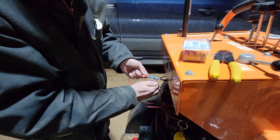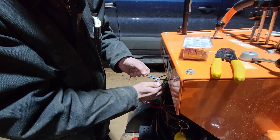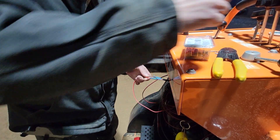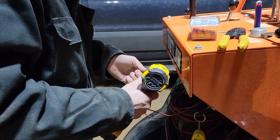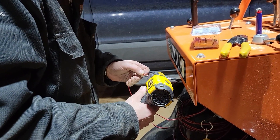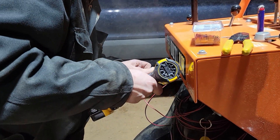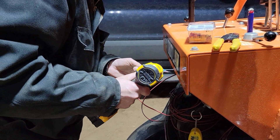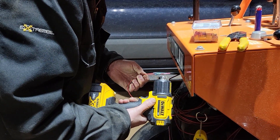I originally tried out a tracked version of a Toro and I absolutely loved its power and liked the tracks, but it was just too big. I needed a smaller, shorter machine to make the turns in the stalls, and this one is ideal. It's really the same dimensions as the Dingo diesel that Toro makes, but it's got more power — a stronger engine than the Kubota I was going to buy. The Kubota was going to be 22 or 23 horsepower; this one's 27. So it's got more power, more lift capability, and it's definitely got more speed.